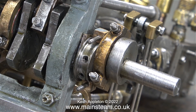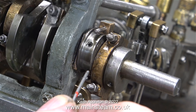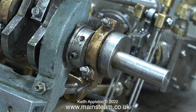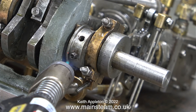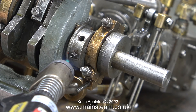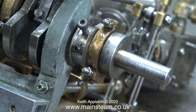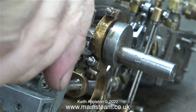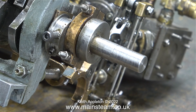Some parts of the construction of this engine are a little bit strange. For instance, there are two grub screws holding the eccentric sheave onto the crankshaft — one of the grub screw holes is in the middle and the other is not. So I removed the second grub screw and put it in my box of 4BA grub screws. The grub screw I left in place was the one that goes through the highest point of the eccentric lobe. Even after removing one grub screw and slackening the other, the eccentric sheave would not rotate on the crankshaft, meaning it had likely been held in place with Loctite or a similar retainer. After heating up the area to destroy the bond, the eccentric sheave now moves freely on the crankshaft.